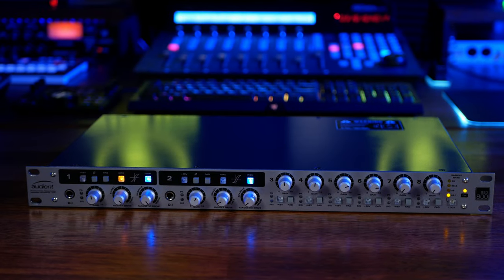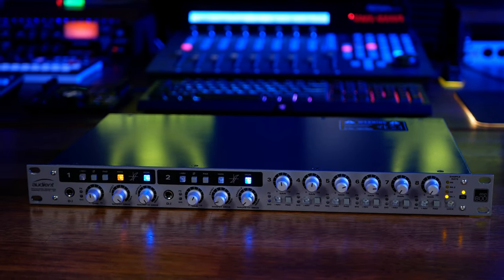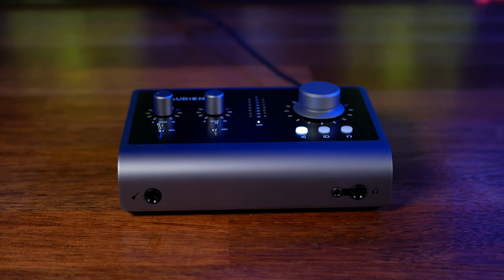However, that's not always possible. In the case of the ID14 Mark II and the ASP800, they have a one-way connection going from the ASP800 to the ID14 Mark II, which means clocking information cannot be sent from the audio interface out to the mic preamp. So in this case, we need to have the ASP800 — the mic preamp — as the master, and the audio interface as the slave. But with some other devices, it can be done the other way around, and we'll look at that later.